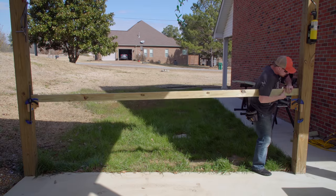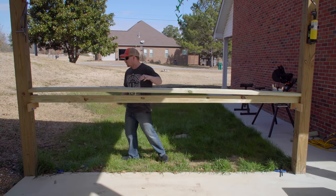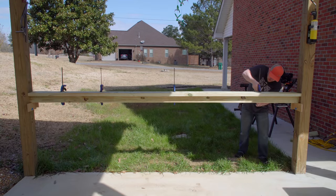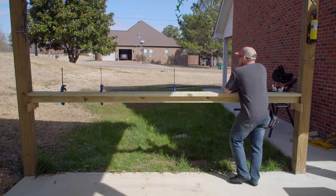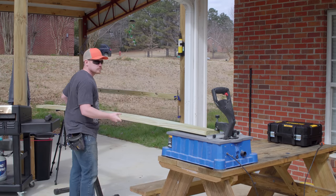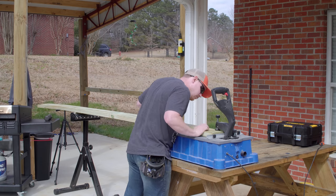The top 2x4 board is test fit first, followed by the horizontal 2x6 board on top of it — and as you can see the 2x6 is kind of crazy. Some clamps are added to make sure it'll all work, and then some practice armrests and elbow leaning took place to confirm I didn't want to adjust the height. I decided I didn't want any screw holes on top, so I chose to use pocket hole screws for all of the frame construction.